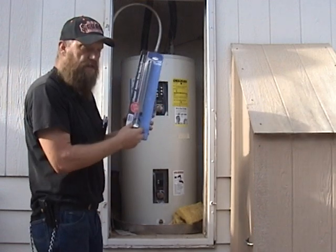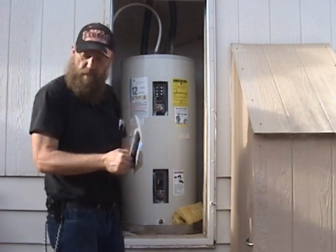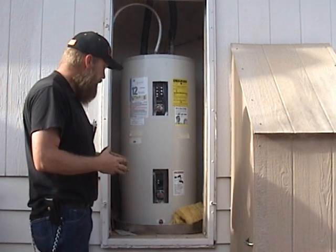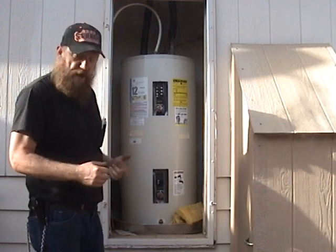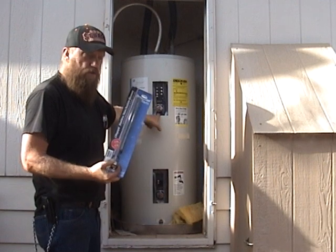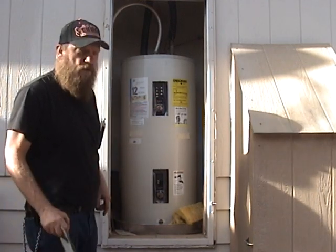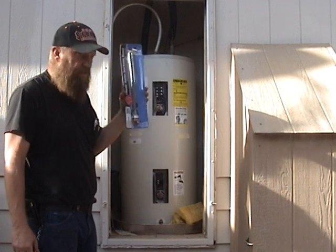Why am I showing you this? The next part of saving money — after you've disconnected the lower element — is this: if your breaker panel is somewhere you normally walk past, like in a hallway or kitchen, somewhere convenient, turn the water heater on and off only when you need it. What I found is with this 5500-watt element installed in the upper section, I can turn on my water heater and in just five minutes — from cold — get hot enough water to take a shower. I pop out of the shower, flip the breaker off, and don't run the water heater again until the next day. So I'm using very little power to heat my water, but I am using a 5500-watt element.